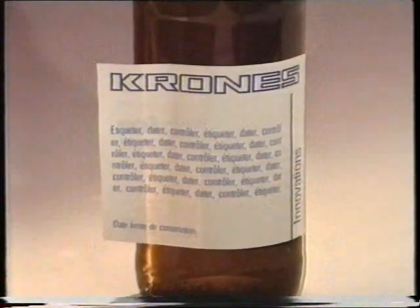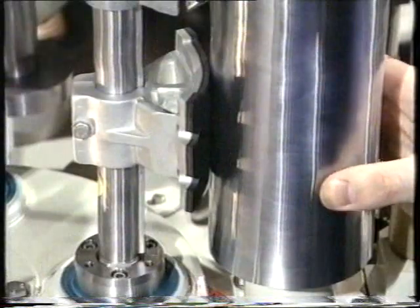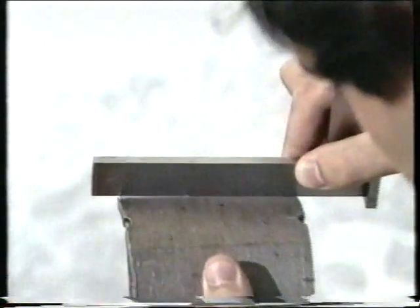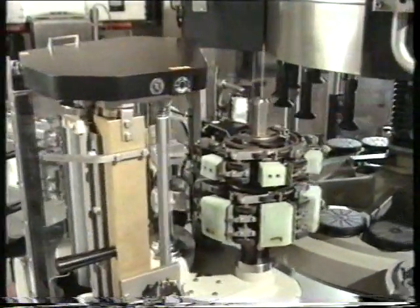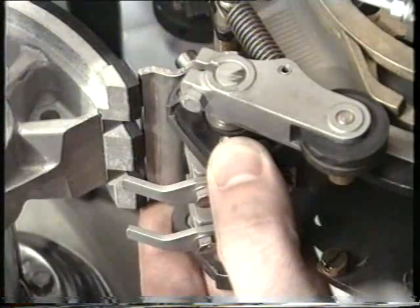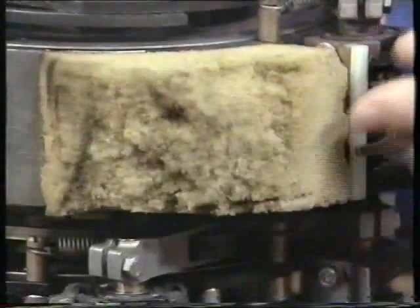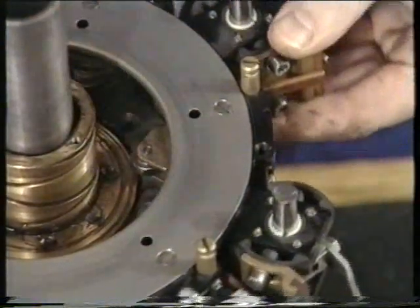If the label is glued on only one side, the path of motion of the pallet should be checked. If there is no glue on one of the corners, the cause is usually a bent pallet. However, if a gripper segment is involved, it can be the condition and adjustment of the anvil bar, contaminated gripper fingers or their adjustment, a sponge which is badly worn or whose shape differs from that of the others, and in case of grippers with pushers, a broken spring. The sponge would then be strongly contaminated with glue.